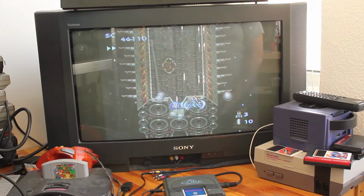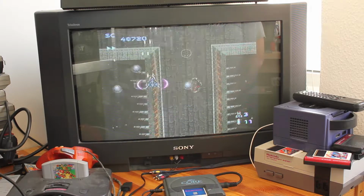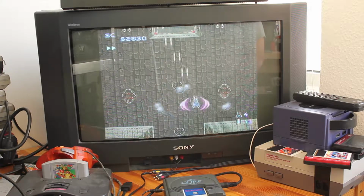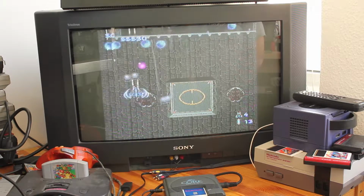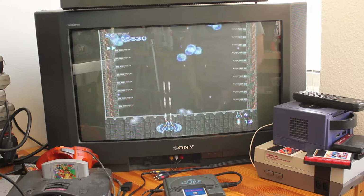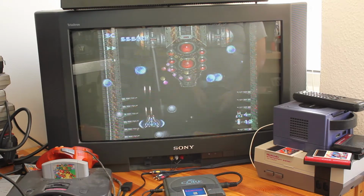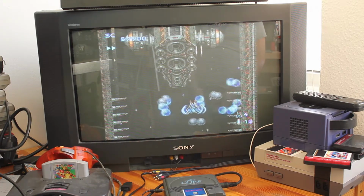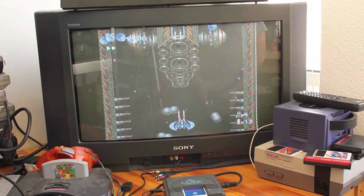And there we go, all working, fantastic. So what did we do? Well, we built a small circuit on a bit of perforated circuit board. It was 2 analog switches, and then we put an external switch on the console. So what we're doing is switching between 8 pins. For PC Engine games, it's one configuration, and for TurboGrafx-16 games, it's the other. We also had to lift pin 29 on the 6280 chip and take that to ground, and that's something I didn't catch in the video. Yeah, that pin needs to be grounded. If it's not grounded, then you'll get unspecified behaviour. I was getting some weird behaviour. Grounded the pin, it solved the problem.